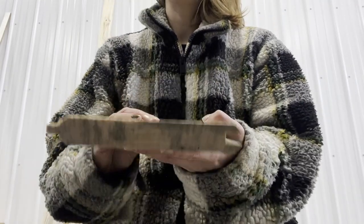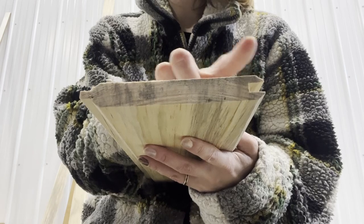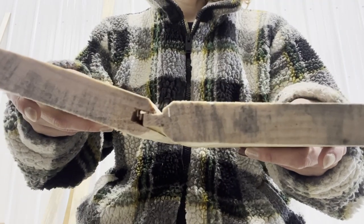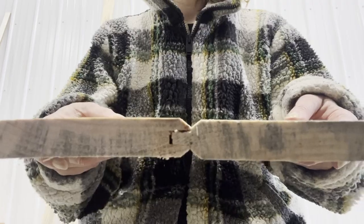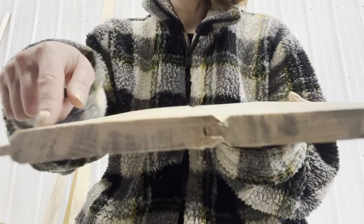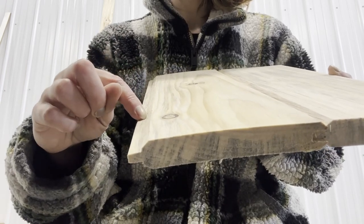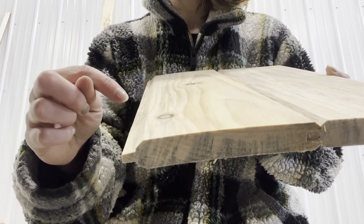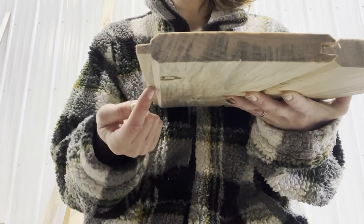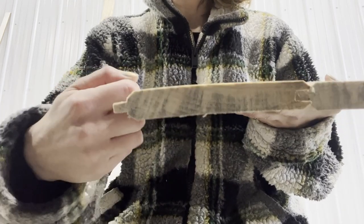Not wanting to miss out on the gender conversation, tongue and groove pine ceiling has a female and a male in it. When installing, it'll be secured like so. This side of your board is going to be held in place by the tongue and groove design. This side, you're going to want to add some nails right into the crevice along here, making sure that you've got your brad nailer on an angle. If you go straight up and down, you're going to have a nail popping out the back side and that's going to affect your ability to slide the next piece into place.